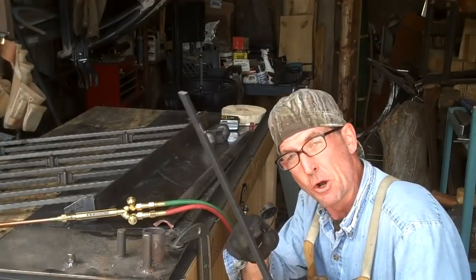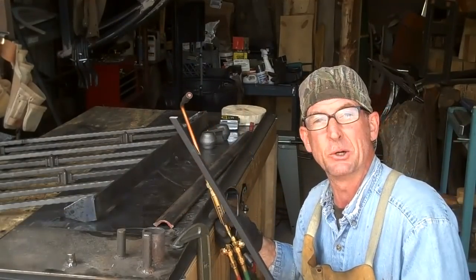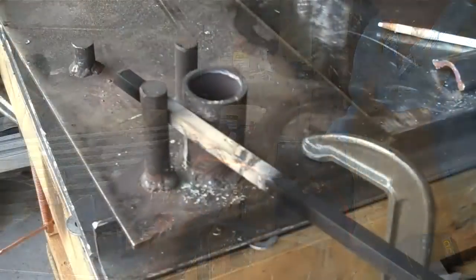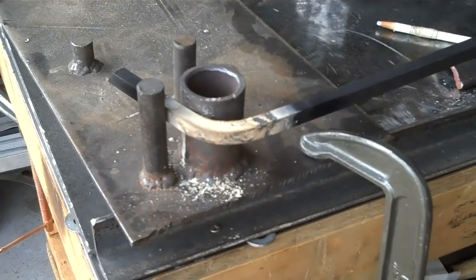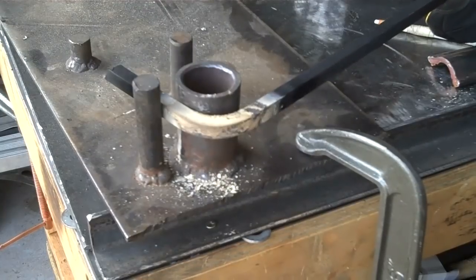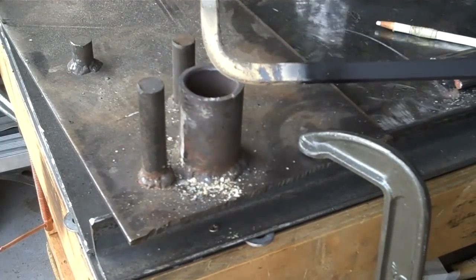Just so we don't have to force it, I'm going to go ahead and use some heat. We're going to heat this up and put it in here and just put a 90-degree bend in it. We just want to get a 90 in it. If we go a little too far, we can always bend it back. About like that. We still have to cut these off, but we're going to let it cool while we're doing that.